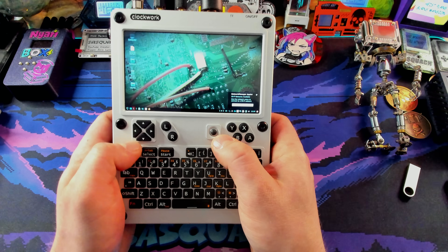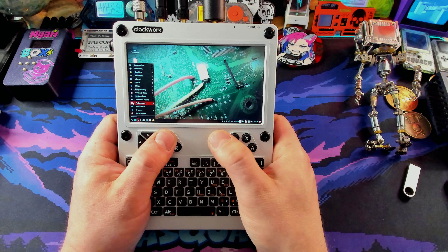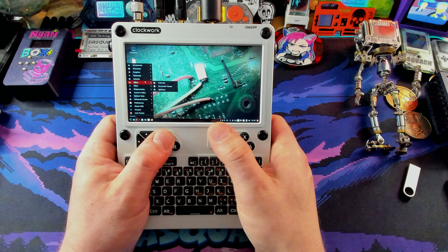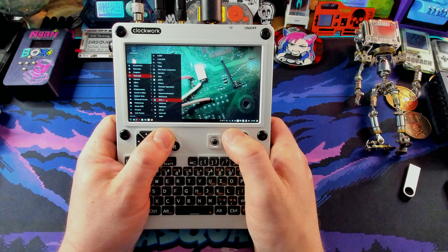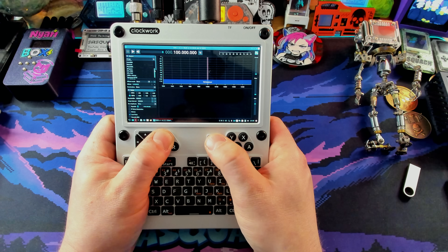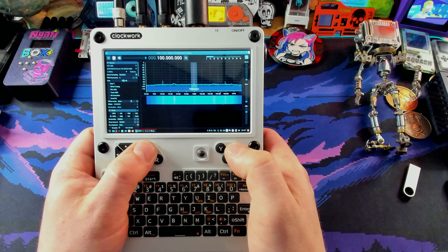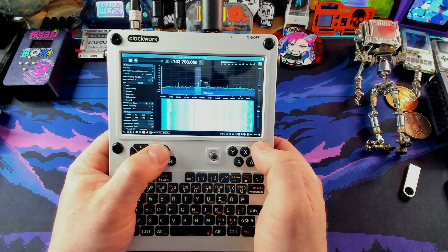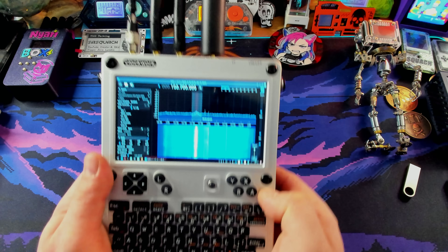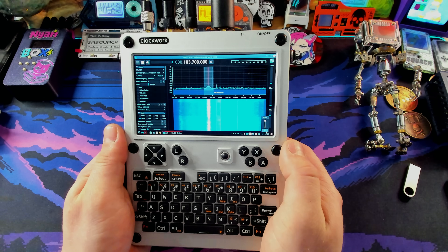Here we are with Ubuntu. You may ask why Dragon OS — well, this OS is designed specifically for software-defined radios, which is exactly what we want for this setup. Let's start off with SDR++. The trackball is a little janky; I've heard there are upgrades for it, but it's good enough for now. We're going to change our source over to RTL-SDR and turn our gain up just a little bit. It's actually working — that is so freaking cool. Let's see if we can find an actual FM broadcast. There it is — we have working SDR. Having a handheld computer like this is so nice. It's got a full keyboard, GPS, an external Wi-Fi antenna, your LoRa device, and then the SDR antenna. This thing could not be more capable out in the field.